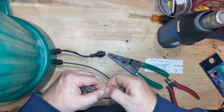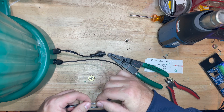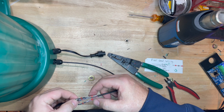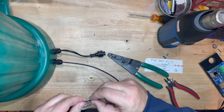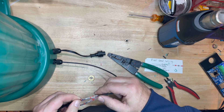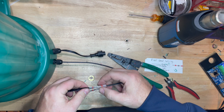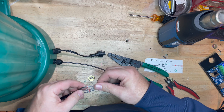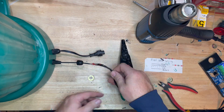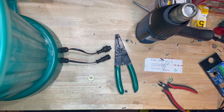There's my male end hanging out there. I'm going to strip the other side and attach the female end. Once again I take my Belden 9451, twist those wires together, make sure the flared ends are on top, slide the flared ends over the cable, and heat shrink those down. I like to really try to make them perfect because it just gets you in a good habit. Then I slide everything in, make sure my ends are about equal length, tighten up my PG-7s — and now comes the fun part.